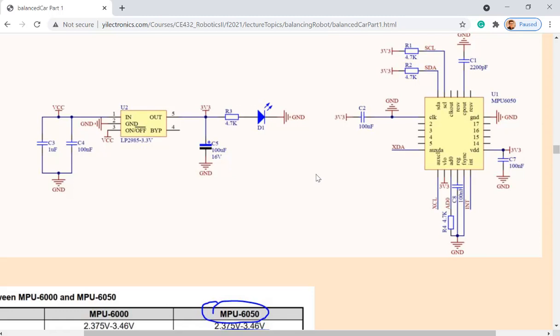But in that case, the chip, the sensor, which is a micro mechanical system, a little gyroscope, is going to be horizontal, right? Not perpendicular to the board. Which is fine, you just need to change the parameter in the code, right? It's a three-axis accelerometer. Doesn't matter which one you are using, it's gonna be the same effect, right? So do not use a module of MPU 6050. Use this schematic and convert everything on your PCB.